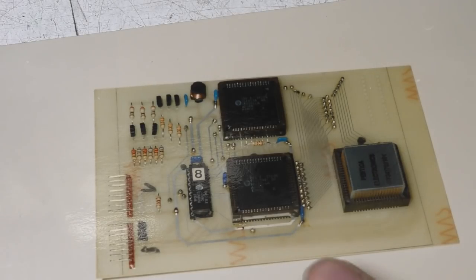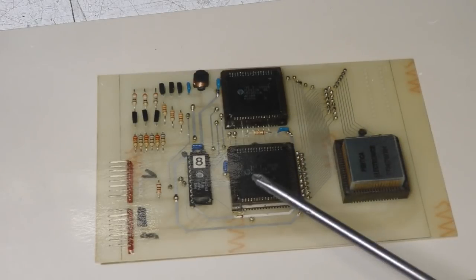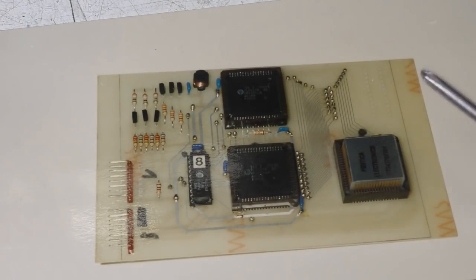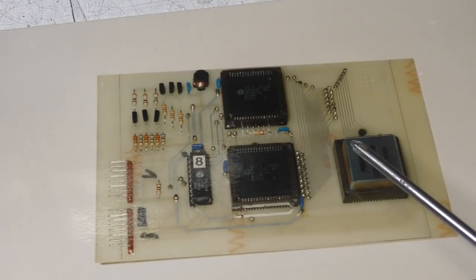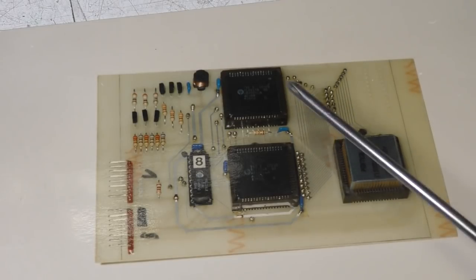The memory controller on the Archimedes actually had 2 DMA channels. One of these was used for video and one was used for sound. Both the video and sound were handled by the video controller chip. So this was just a prototype of an idea I had of whether you could actually drive 2 monitors off the same machine, using the sound DMA channel to run a second video controller. Yeah, I'm pretty sure this did actually work.